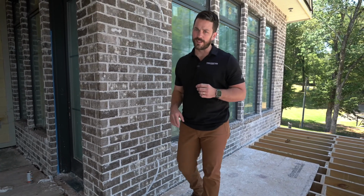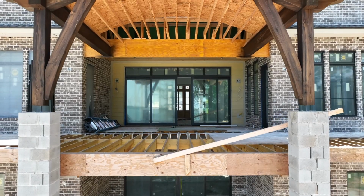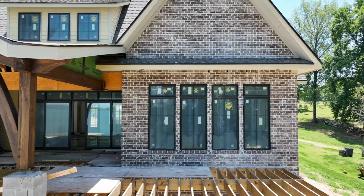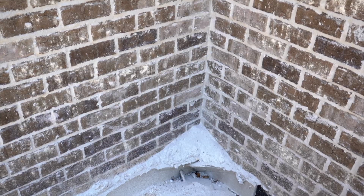So one thing I'll point out, as a builder, you should really be paying attention to brick details on a house. So when you receive a set of plans, now, this is assuming that maybe they don't have a structural engineer involved, or maybe not a full set of architectural drawings. And I feel like most homes in America are built without either one of those things, unfortunately. But if you see brick above decks or brick above roofs, red flags should be going off, and you really need to pay attention to those details, because that's a huge weight load that you have to make sure is accounted for. Obviously if brick's coming off the footer all the way up, it's carrying its weight down to that footer.